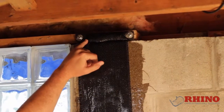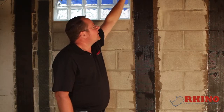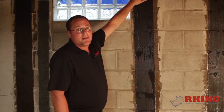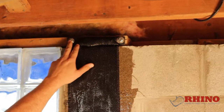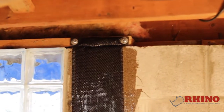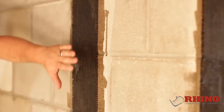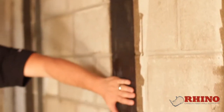When you look at the top of it, we actually connect to the foundation above. We connect all the framing to the foundation here with a bracket that not only adheres to the sill plate, but it also bolts into the sill plate at the same time. This is the strongest strap on the market today — it takes over 50,000 pounds of pressure to break this strap. At that point, the last thing you need to worry about is your concrete block wall in the basement.